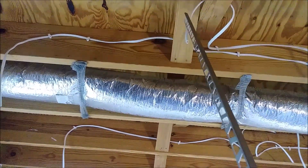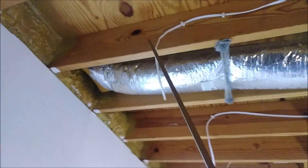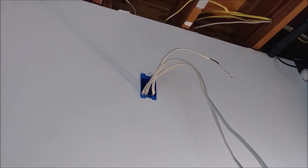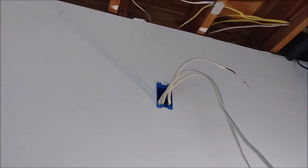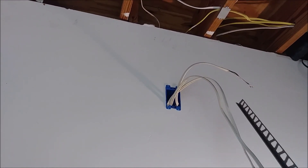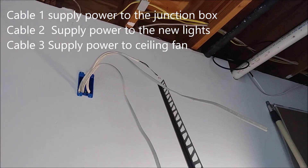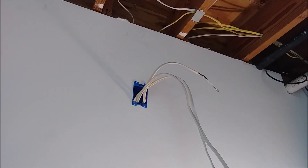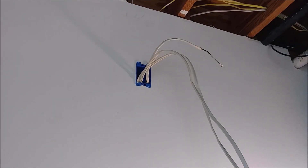This is actually a two-wire cable. So that is for the fan and the light. What I want to talk about is the junction box. A junction box is a box that has a number of cables, where each cable connects to the others, but only one of them supplies the hot — the rest take the hot from it. So in this room, I have one wire going to the LED lights, another wire going to the motor, and another wire that supplies the hot.